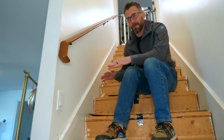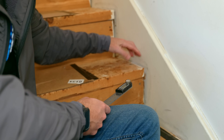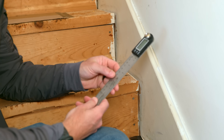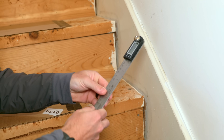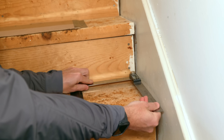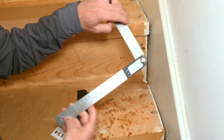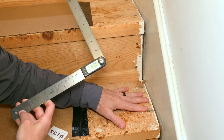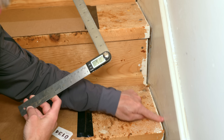It's going to be a lot of extra work, but I think it's going to be really cool. Before we get to the custom piece, I wanted to show you how to figure out the gap. This is a digital angle finder — you turn it on, zero it so you have no angle, then spread the arms out, put one side against the back, the other side against the outside, and you can see it's actually 91 degrees. So when you go to cut the stair with the miter saw, just set the saw to 91 degrees instead of 90 degrees and it'll meet the wall.